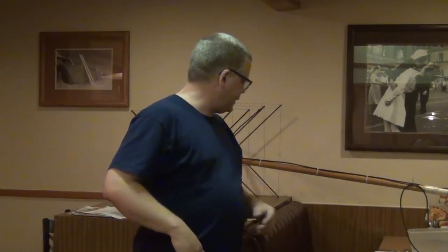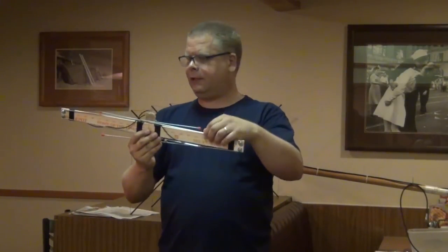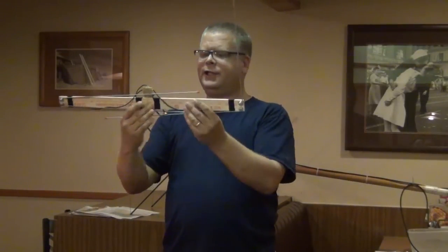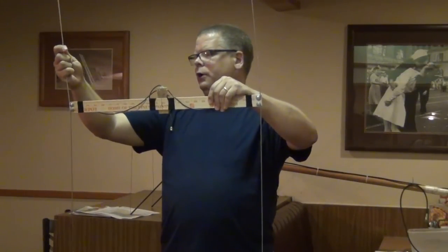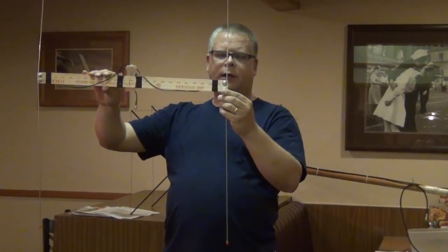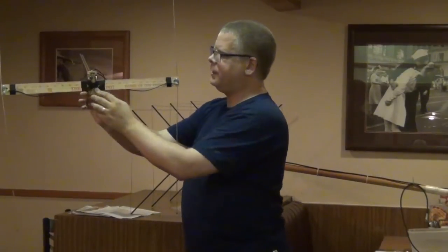for sniffing. I want to show that one. This is one that I just recently built, and it works on the principle of a time difference of arrival, or TDOA. Basically, it's got two elements that fold out. These are both dipoles here, so one active and one counterpoise. And then I've got a little chip on here that basically is working.